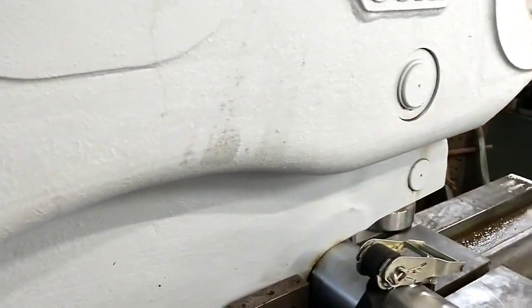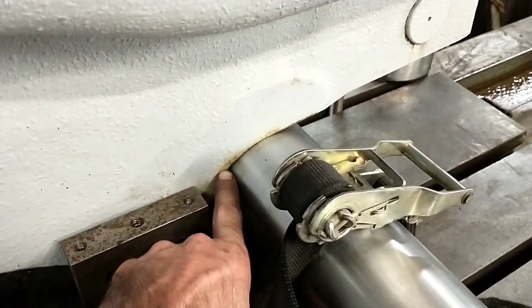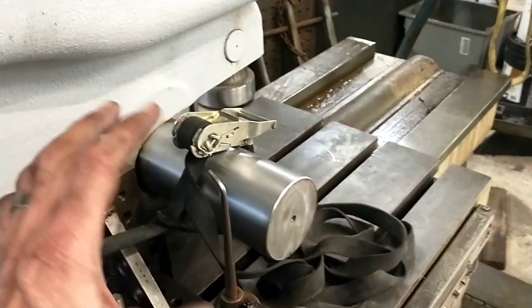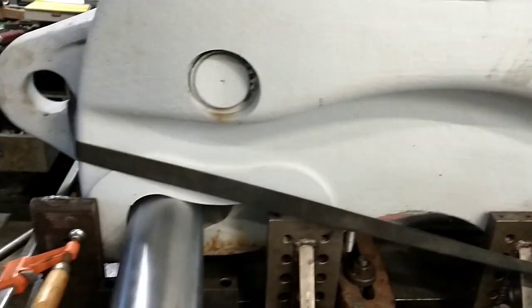So here's the deal. Down on the bottom end, because they're kind of a one-size-fits-all, it's hard to tell what you're seeing here, but these are machined to accept a 100mm pin and then have a little scallop out of the edge that's 90mm size, so that they'll come up nice and tight. You can't tell it with the pin in here, but there's kind of a bump in that bore that fits the 100mm. So I grabbed a 100mm there.